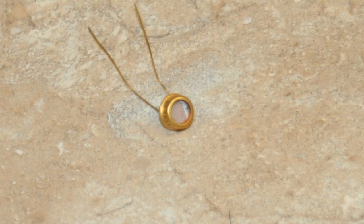This right here is a cadmium sulfide cell. I imagine a lot of people are familiar with these as dusk-dawn sensors. Anywhere you need to not just detect whether there's light or no light, but measure how much light is striking a surface, this functions by varying the resistance based on the number of photons striking the surface behind the lens.